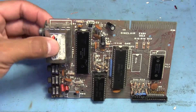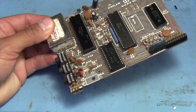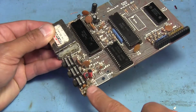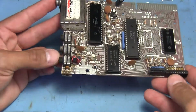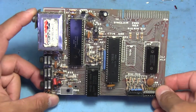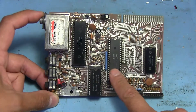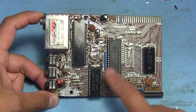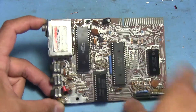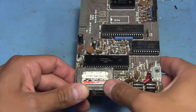I've had this board kicking around and luckily nothing is really missing other than the 5-volt regulator on the bottom, which I must have pilfered at some point. Without the 5-volt regulator, none of this can power up if I put a power supply here, but it's not completely necessary. Everything else is still here: we have a CPU, which is basically a Z80, our ROM, 8-kilobit RAM, and then this Ferranti ULA — basically a custom chip for all the logic and inputs and outputs.